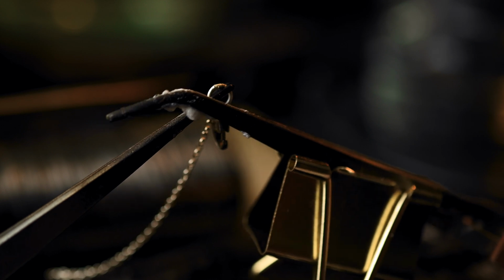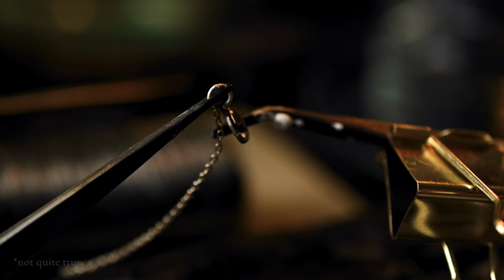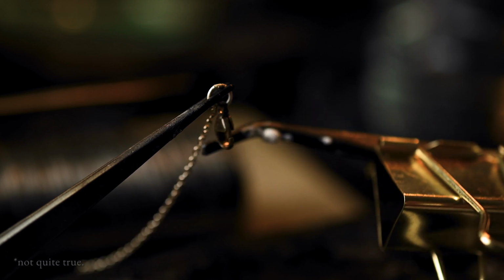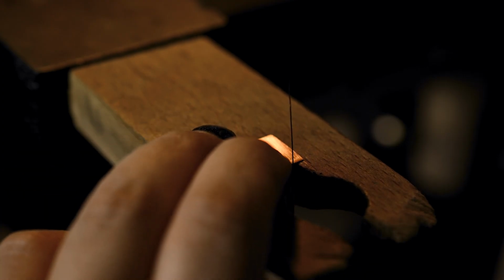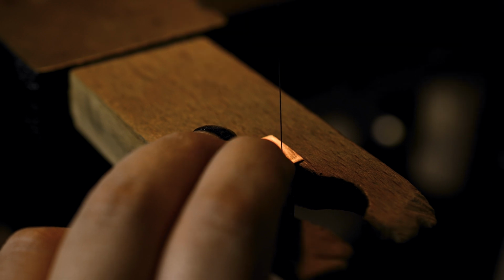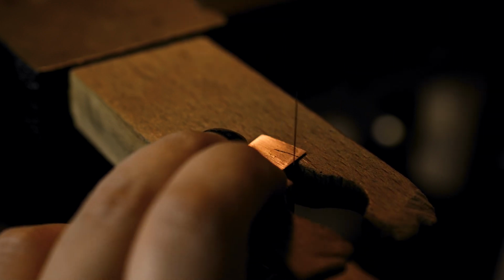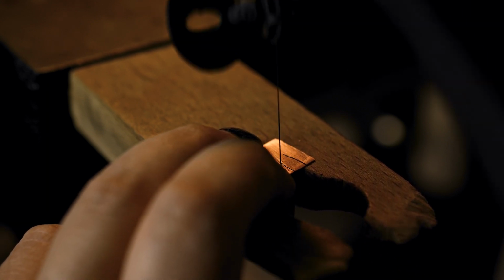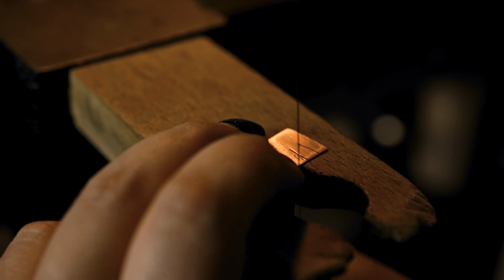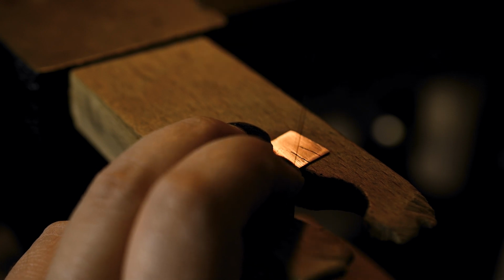Lastly, as much as we've heard before that solder will not fill gaps, well, that's not quite true. In my work, I really like adding decorative cuts, and I'll usually use an 8/0 blade to do that. The problem is, this is such a tiny cut that the solder will absolutely flow into it. I've learned that the hard way. If you want your metal to be clean for the solder to flow, you can also make your metal dirty for the solder not to flow.